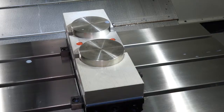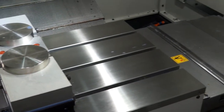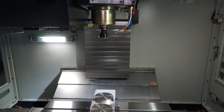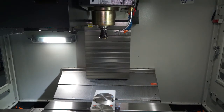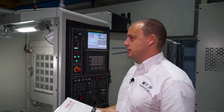In terms of the axis drives and the way the machine is built, the Z axis is built on a box guideway construction, and the X and Y axes are on linear rails. So you've got a good compromise when you're looking for rigidity and speed — speed for the linear rails, rigidity on the Z axis with the box guideway.